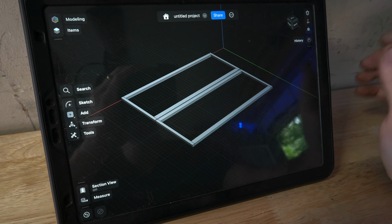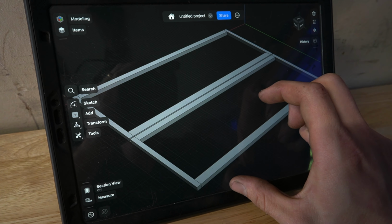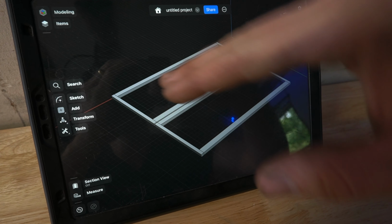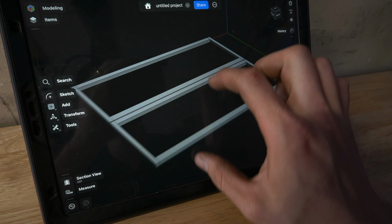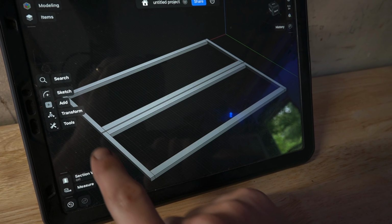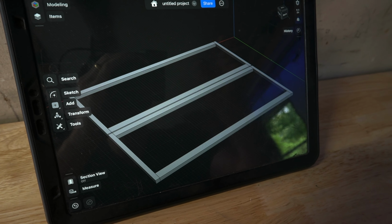Our roof is still going to lift the same height, but instead of having our hinges fold like I was just showing you, it's going to fold more like a book. The benefit of this is, as it's folding on top of each other, it'll have plenty of room for the fabric to lay in between there, and also it won't be trying to give it a scissor action on the sides, so it should help with the longevity of the fabric in general.